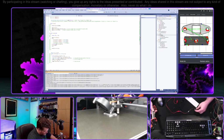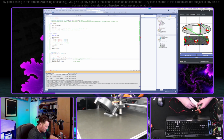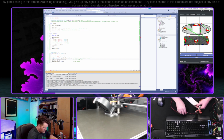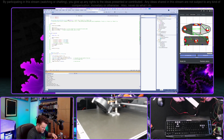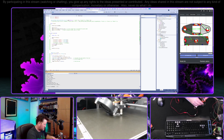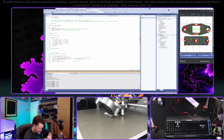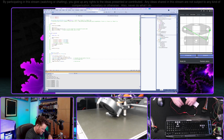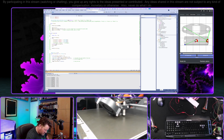We are going to need, let's see, two of these inputs. We also certainly need to share ground. Right? Or these have opto-isolators in it? I'm not sure. This is low enough voltage that we'll go ahead and share ground just to be safe. Black, shared ground.